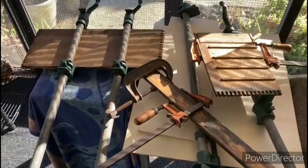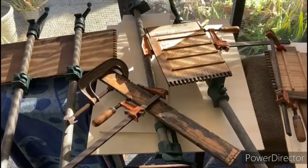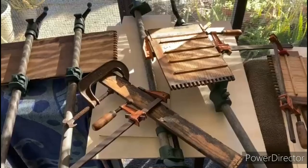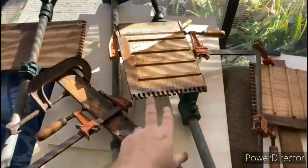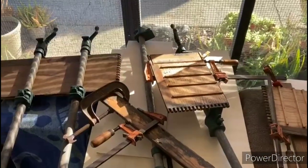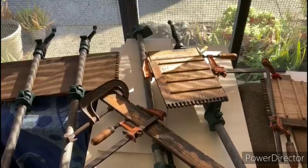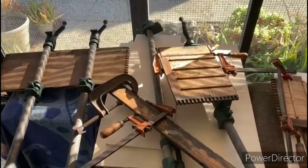So that's some of the pieces where the wood is joined together, and that area is not supposed to come apart. When we reassemble the box with these finger joints and things like that, in those areas we'll use the hide glue. But in the other areas that are never supposed to come apart, like these that I just fixed here, that's just going to be the carpenter's glue.